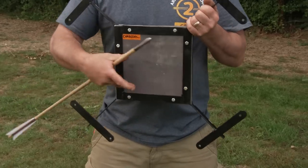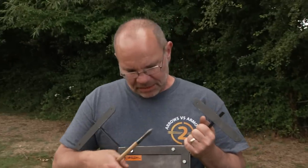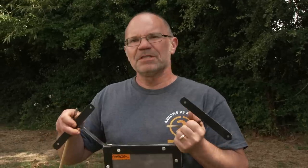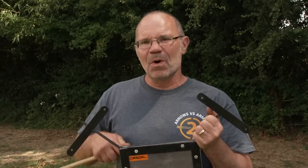We've got flat plates like this one mounted in a frame, and we're going to put that on our archery foam targets. All our samples are 1.5 millimetres thick, so they may resist the arrows or they may not — we're actually not sure. We're starting with a charcoal iron, a bloomery iron — zero percent carbon, so it is not steel. We also have cross-laminated wrought iron, normal wrought iron, mild steel, and high carbon steel. It's a comparison, not a piece of armour; it's flat, but it allows us to see the difference between one arrow impact and another.